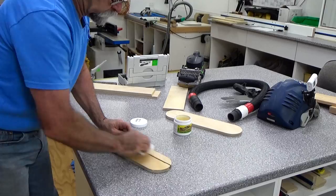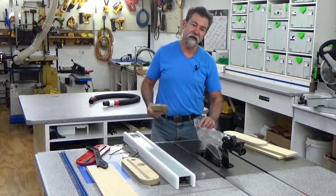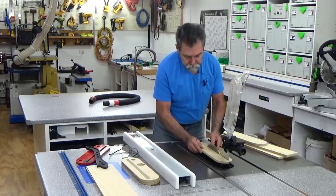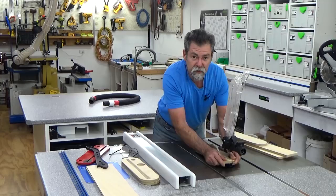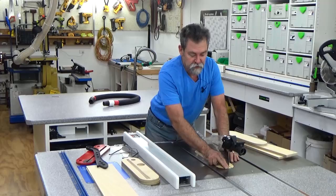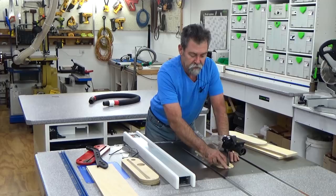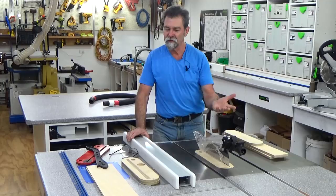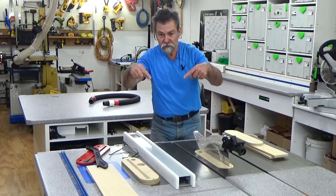Does it work? Can I use it? Well rather than take that out, how about I just pick this up — I open this up a little, push out the pin or the domino, slide this along, put the domino in the back and notice no movement there — drop it down. How easy is that? There you go, and I'm ready to start cutting. I don't have the problem where pushing timber through gets caught on the outside of the throat — that area is notorious. If the insert is wobbling around you will catch timber there and that can be dangerous. Thanks for watching — check the description box below for links and keep coming back. Give me a like if you think it's worth it and I'll see you next time.